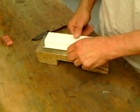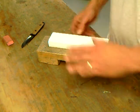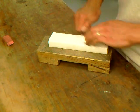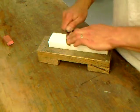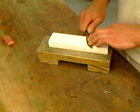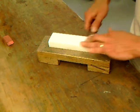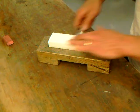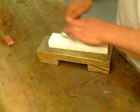I'm going to go to a regular sheet of paper here. This has been pre-compressed big time, and I'm going to use a little more pressure yet again. Initially I'm going to go pretty light. Right now I'm following the curve. What's happening is I'm pulling some of the abrasive off from the compound and the swarf. The paper with these fine points underneath is applying so much pressure that it's actually smoothing a lot of the high points on the steel — where the grind path was, the grind tracks. So I'm burnishing a finer edge, cleaning it, and making it more uniform.